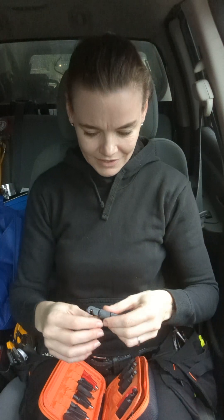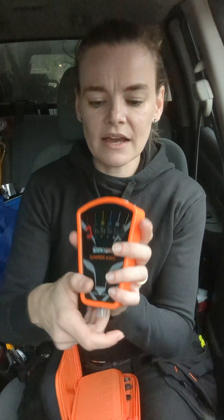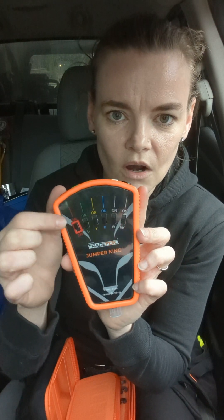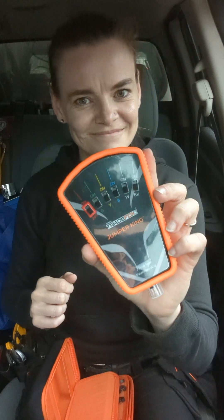All you do is pierce your low-voltage wire with the piercing lead, and you've made a connection — how cool is that? That allows you to hook up each one of the terminals. Make sure they're all off when you hook them up, then you can turn one on — say R and cooling, or R and heating. And that's how you can test it, with it being super safe.